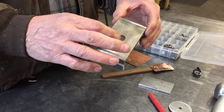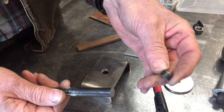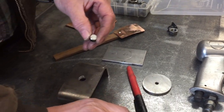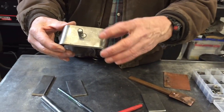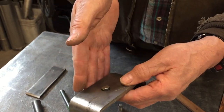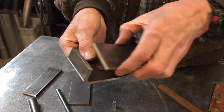Now I had some questions about filling holes in the frame. Let's say you had a hole in your frame. What I do is I take this round stock — I have it in all different diameters, this one is almost half inch. Before I cut it off, I take it over to the grinder and spin it to put a little bevel on it. Then I take a magnet, stick it to the edge, pop it in the hole, go ahead and tack it, move the magnet, tack the other side, weld it around, and grind it smooth — the hole is gone. Then I'll go to the inside and weld that as well, so it's super solid.